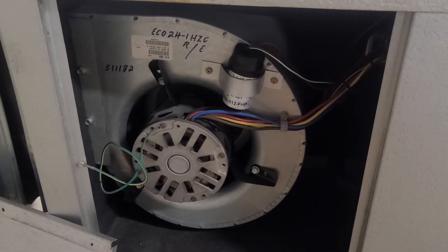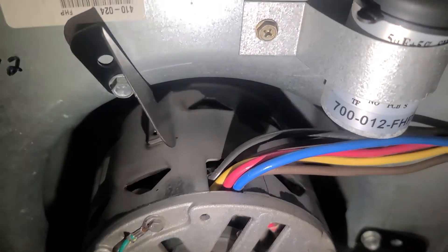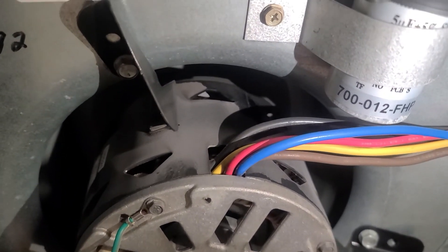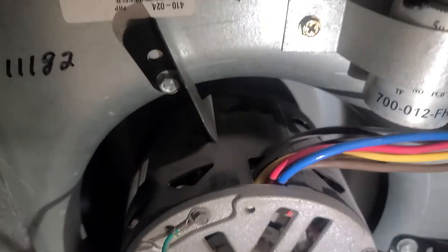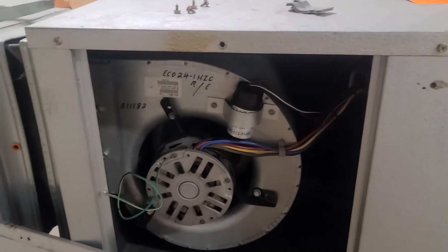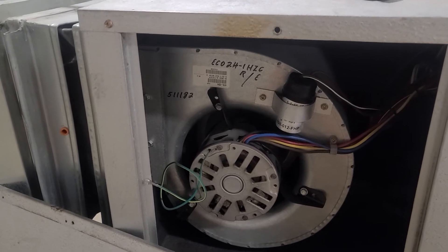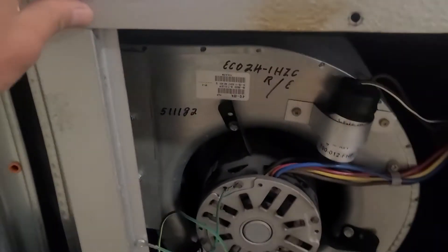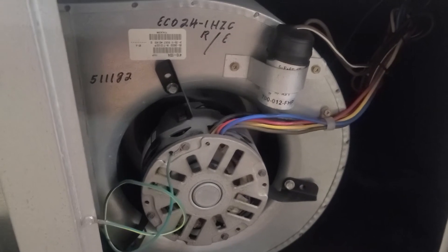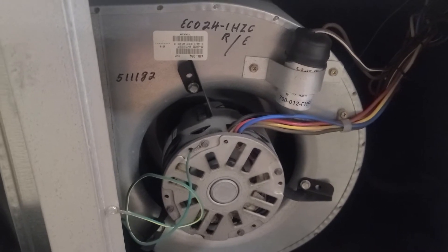You can see the discoloration on the blower right there in the dust, and you can see it a little bit back here too. Everything is sealed on these, but over the years I've seen where they'll start to leak a little oil out of the seal — could be a bad seal or something like that. I'll document them, and if it's a critical area sometimes people want to be proactive and replace it before it actually fails.